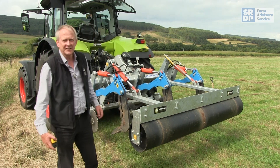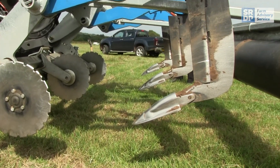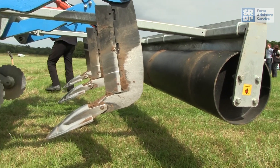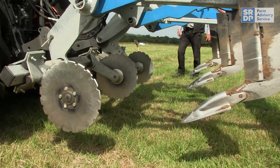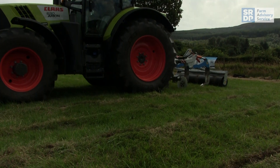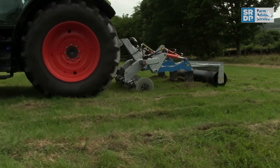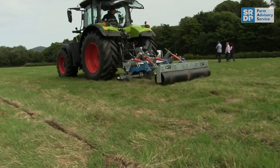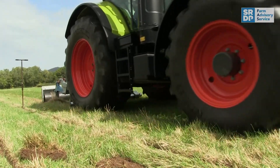They tend to be designed in a fairly similar fashion. We have a leading disc, and that is important because it helps reduce the amount of drag that you're pulling through the ground. We then come into the working part of the machine, which can either be a typical subsoiler-type tine with wings, or in this case it's a more elongated tine - but the same idea of trying to get in below and open and crack up the soil. Most of them now have a self-leveler at the back which also serves to adjust the height to make sure you're working at the right depth. This one is working with a flat roller - some have spikes or lugs on the roller, which helps to open up the topsoil a wee bit as well.